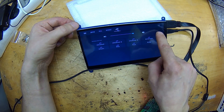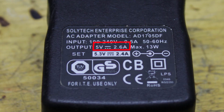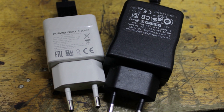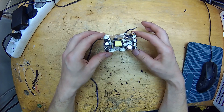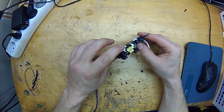This screen does require additional power. I used a 2.6 amp power supply for the Raspberry, and apparently that thing can't handle any additional load. Now a 5 volt supply with more than 2.6 amps is kind of rare to find. In my builds I always try to use as much stuff as I can get from the dumpster to save some money and the planet. So first I used two supplies, but if you use two different power supplies you will mix two different plus 5 volts in the same system, which can result in ripples and all kinds of unexpected behavior. Luckily I did find a power supply board that produced 3.7 amps — I measured that — and using one supply is a much better way of powering this whole thing: the Raspberry and the screen.